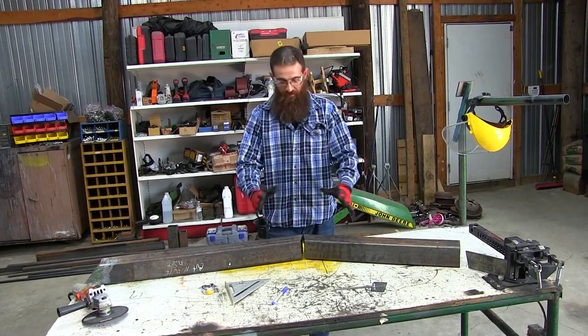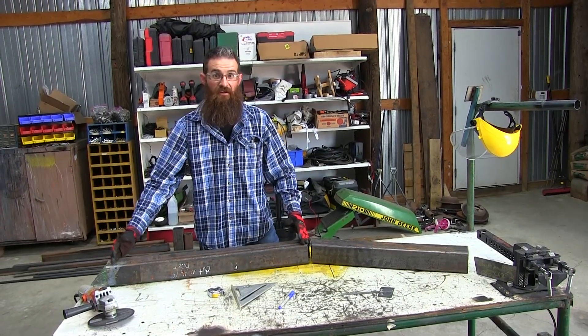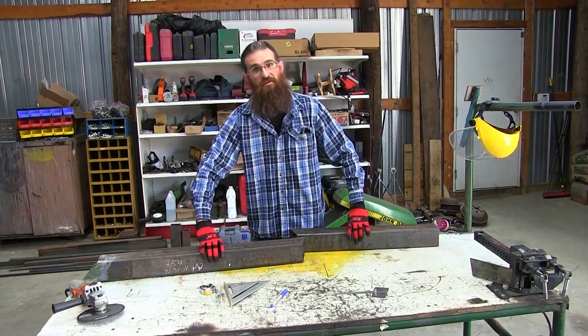Since this arm is actually bent compared to the plans, once I start bending it, it's actually going to give us the bend of the arm. These pieces are ready. From here on out I just need to measure this piece out, cut it to length, cut it off, and be done. Then we can move on to actually making the brackets and start drilling the holes.